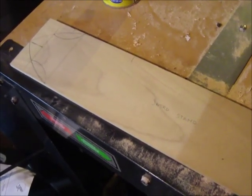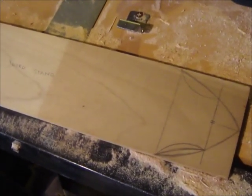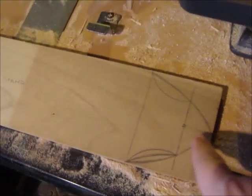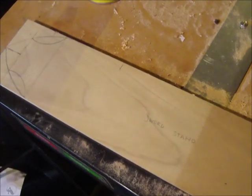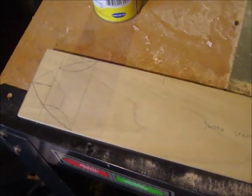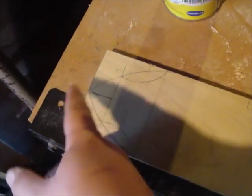I want to be able to have a design that you can use for either a wall mount or just standing on a shelf. So I made it 18 inches long so that you can mount a 16-inch. If you go in an inch from either side, you'll have 16 inches apart, some mounting holes. Most studs are spaced 16 inches apart in homes, at least in the United States. So this will give you something that you could mount directly to studs if you want, without interfering with the actual sword hanging function. So that's where the 18 inches long came from. I wanted to have 16-inch mounting points and then an inch on either side for overlap.